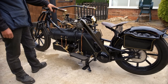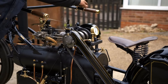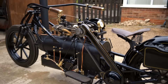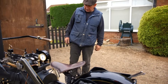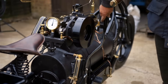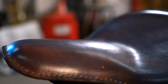So if the engine's turning and you're in motion or just ticking over, you can use the feed pump. Or if you've got it turned off altogether, that doesn't need to be running — you can just turn your steam injector on and fill the boiler up. This has got a four-speed gearbox — a 1950s Ariel Square Four pre-unit gearbox, it's a Burman box. I've got a hand change here and the bonus of having a clutch on the end of the gearbox so I can disengage it as needs be.